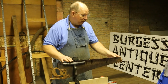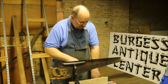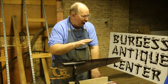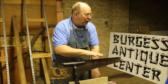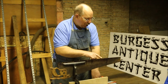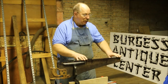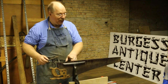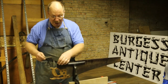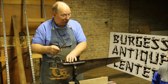When I'm sharpening the saw, I want all the teeth to have little shiny dots on them. But there are only three without dots on this whole saw blade — it's been around a day or two longer than I have. My grandfather would have been a baby when this was made. Rather than taking it down so the shortest tooth is actually working, I'm going to say those three teeth take a vacation. It's not going to hurt the saw. It'll get sharpened eventually again, and those teeth will come back up even with the rest. I start on this end and do two strokes.